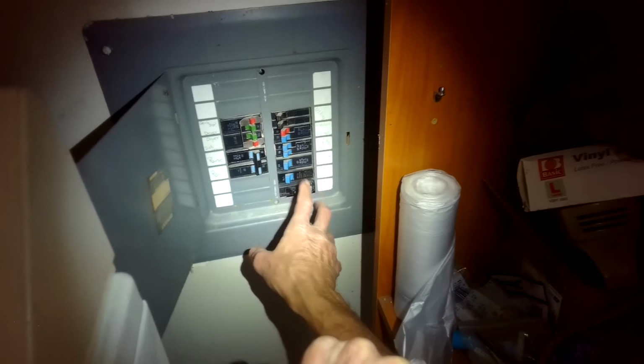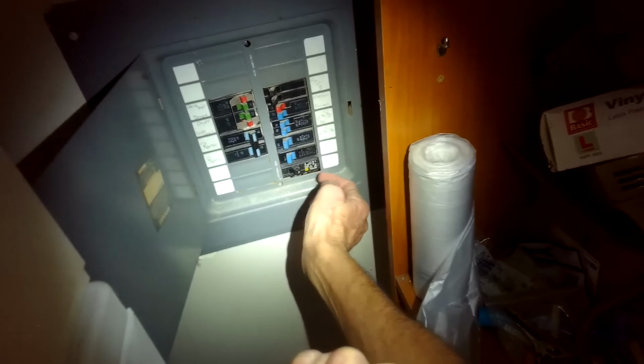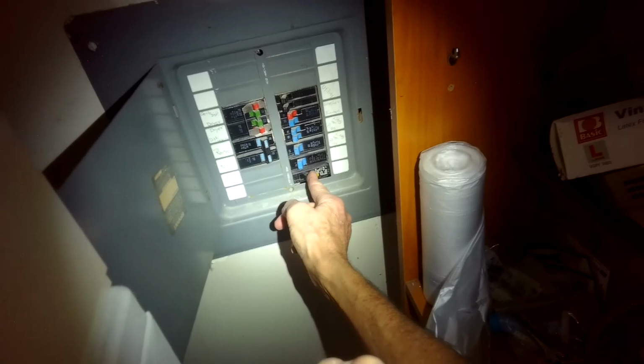We'll go ahead now and plug in our microwave oven to the interlock, to the new outlet. And we're going to turn on the breaker and just give it a little test. We are at the home breaker box. We're going to turn that dedicated 20 amp breaker for the microwave back on. It's on. Close that. We've got power, so everything's working fine.